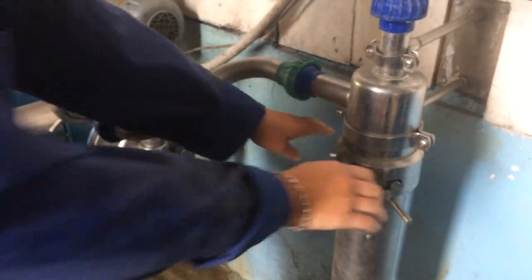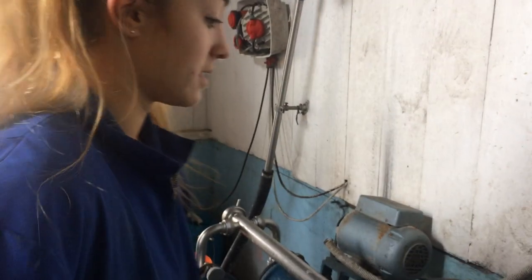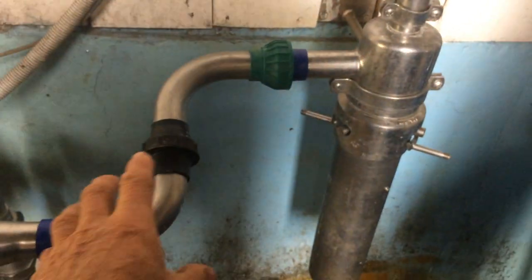So now you've got to turn on some pumps — two pumps. The first is the milk lift pump, that motor there, comes through to that switch there. The milk lift pump sucks milk from the receiving can — that big stainless steel can over there — and then pushes it through the filter, through the plate cooler, up that pipeline, and into the vat. Or into the calf milk, which is what we're going to do right now because of this connection up there.